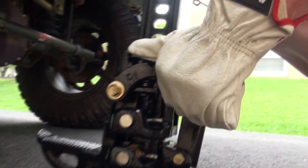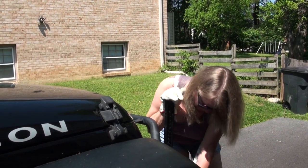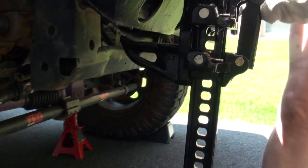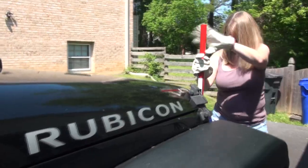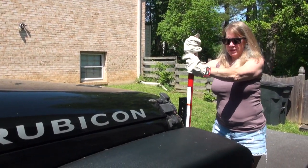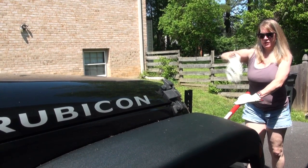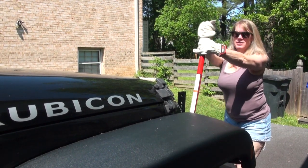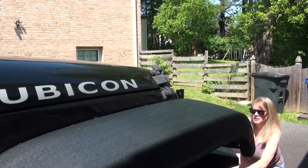Lift the reversing latch to the up position. Then you unhook the handle — the red part — from the bar and you pull it up until it gets right under where you want to lift your load. Then you lock it back in place. For women it's easier to pull down like this — I'm using my hips. You don't want to get anything in between the triangle of death because this is a very dangerous piece of equipment and it could cause serious injury or death.